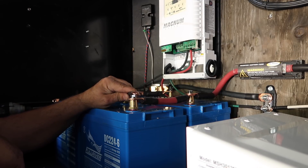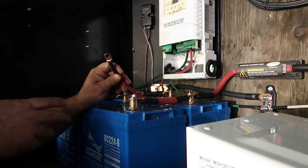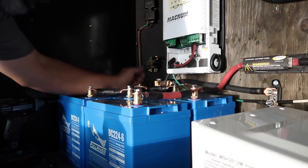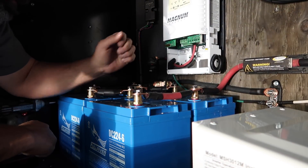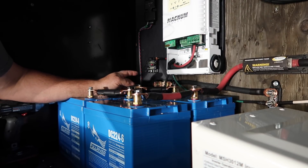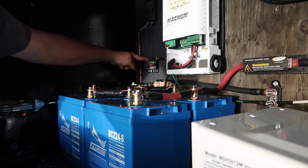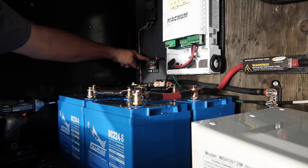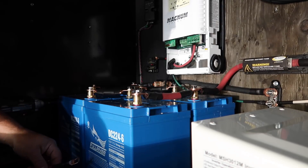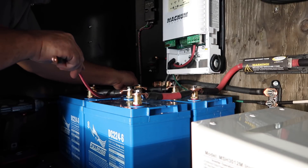Oh, see — it's got power. Something's happening. So I'm not going to hook them up now, but I just wanted to get them all pre-wired and ready to go. I've made a little modification here — I forgot about my solar cutoff switch. I got a 120-amp resettable breaker right back here. That is actually my cutoff for the solar, from the solar charger to the batteries. So now I've installed that and I'm just running my last wire in to make that battery connection.